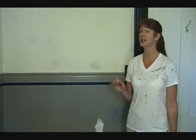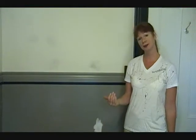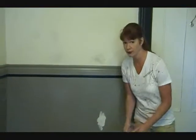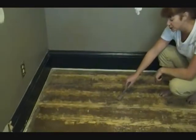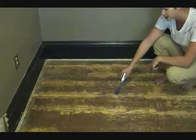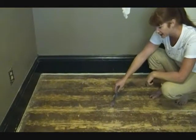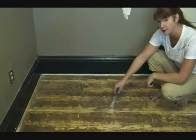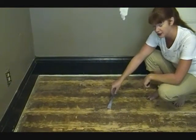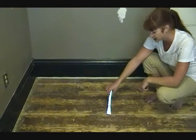The reason being is because I have a lot of sanding to do. You saw what I did with the floor — I brought up the plywood and I saw the planks. So if you want to follow me down, these are the original planks to the house, and there are a couple of spots that are really, really large in between the planks. So what I did was, you can get various types of patch, and I used a very coarse patch that you can use for wood, cement, a bunch of different things, and I just plugged it in.